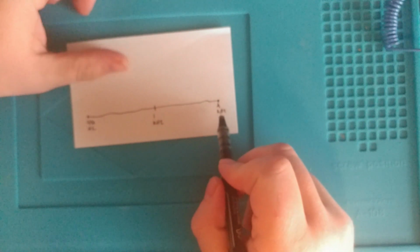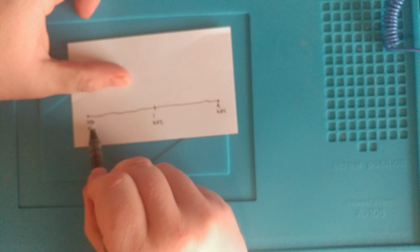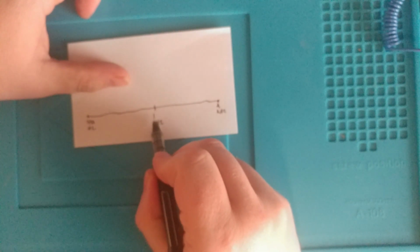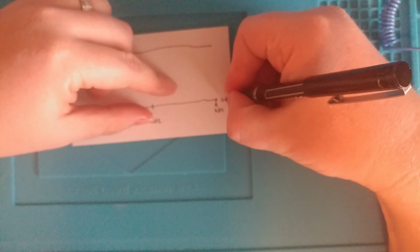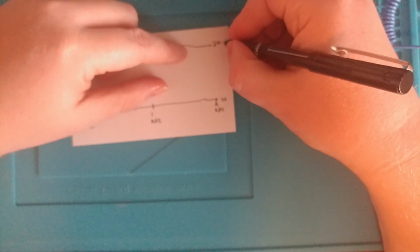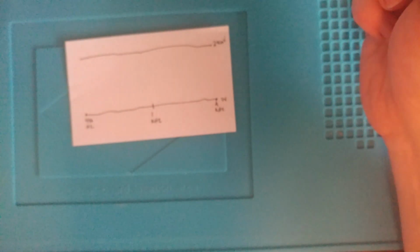So I've drawn a line at the bottom to represent that specific switch. Okay. And it ranges from 400 to 2K hertz, and mid-range is around 1000 hertz, or 1K hertz. Okay, now on this top bar, and this is just me making up, if 0 volts is at the bottom, approximately 240 millivolts would be up top. I think that's what a lot of the measurements came to.